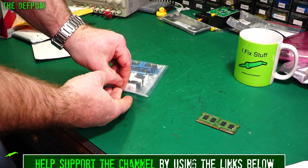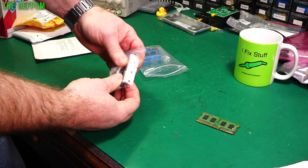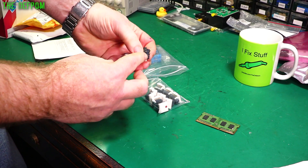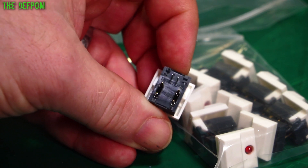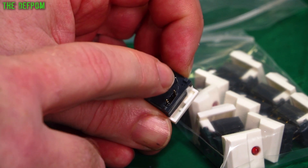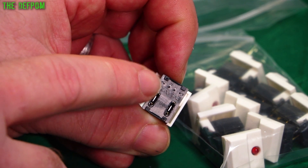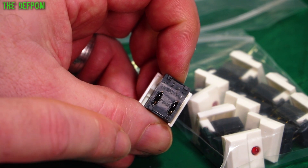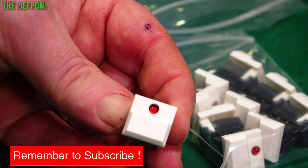Some buttons now. These are similar to ones I've shown previously, which I'll use on some projects I've built, but I wanted some different color buttons. They're double throw double pole switches with an LED in the center. There's the LED and there's the pinouts on the back. The middle ones are the common, one way is the switch, the other way is the other direction, and obviously that's the LED. These switches have a negative pin — they come in different configurations: no LEDs, one LED, or two LEDs, so they allow for that in the moldings.